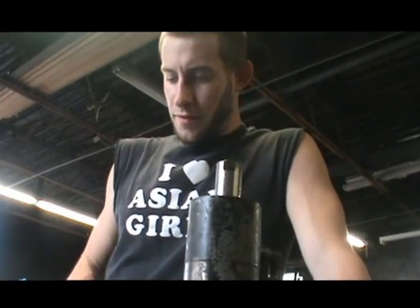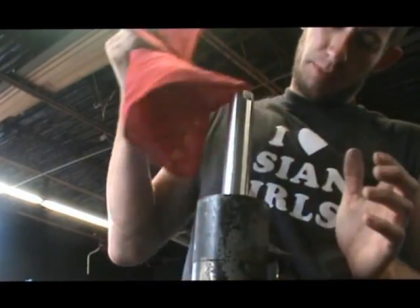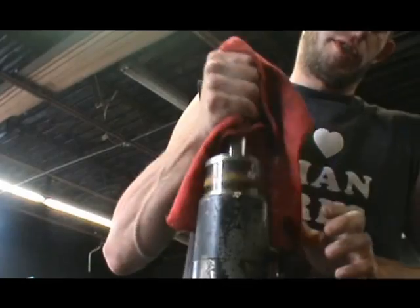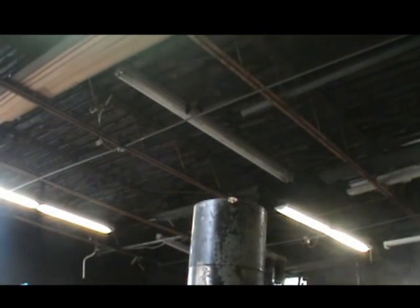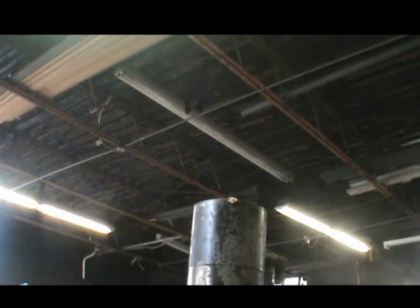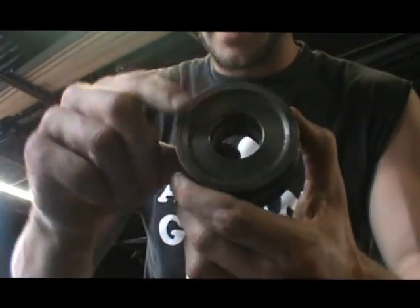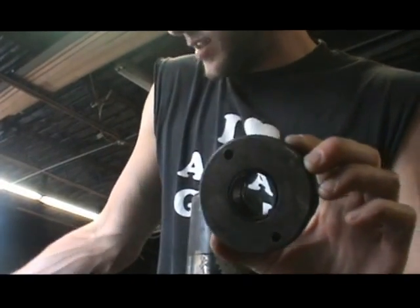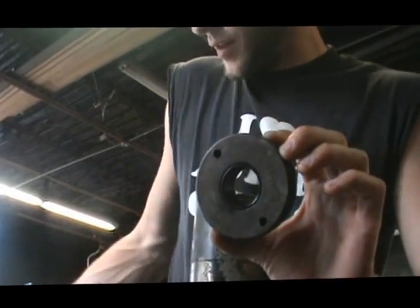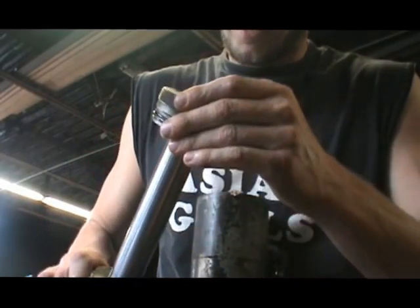Hey internet, it's Bo again. I told you guys I'd show you a video on how to repack a cylinder and I finally got it back. Last video I showed you how it comes apart — this thing has been riding around in the back of my truck the past day or two. Let me show you how it goes. Earlier I showed you the top cap — it's got o-rings there and on the shaft seal right here. Most predominantly where they leak is through this top shaft seal — you'll usually see them slowly weeping fluid out as you're using the cylinders.